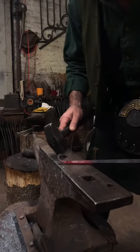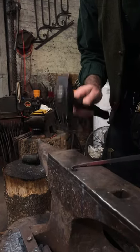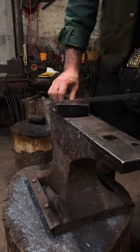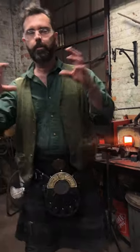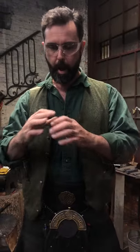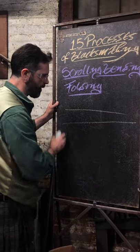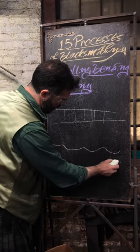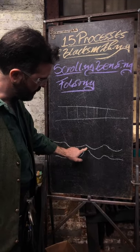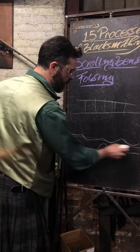It's very tricky to get into the inside if you've already gone past it. Your taper is important. If you have a raggedy taper it's full of lumps, because the pressure returned to you by the section of the material is uneven. If you have a nice clean taper, the pressure is going to increase as you go up the bar. But if your material has thick and thin variations, it's going to predominantly want to kink. So make sure your taper is nice and clean.